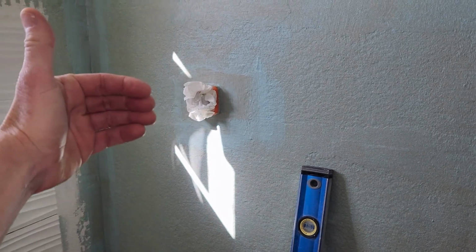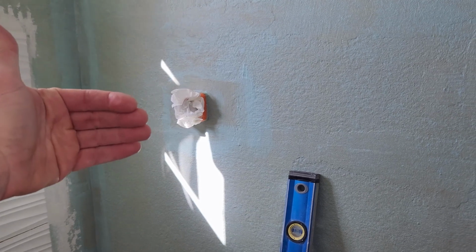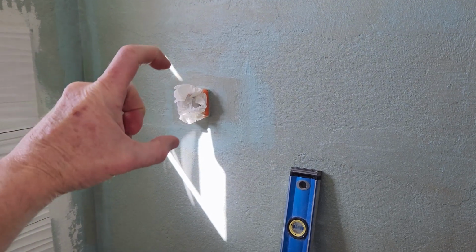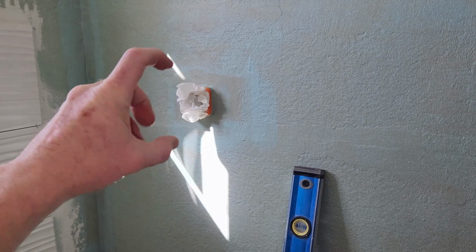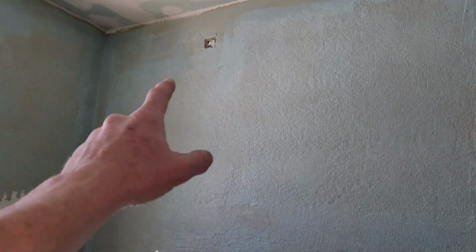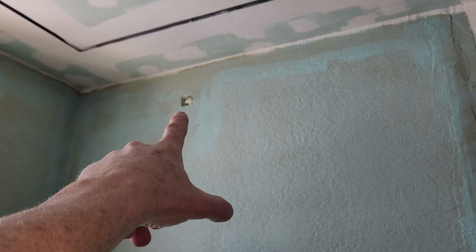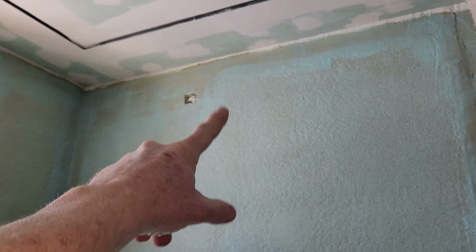Two tiles, unfortunately, get right into this. Only on one side, which is good, but instead of one tile with one circle, it's going to be two tiles. That might actually be better for cutting. And then all the way to the top, we'll have to use a little diamond drill bit I have to make a large hole for the shower head.